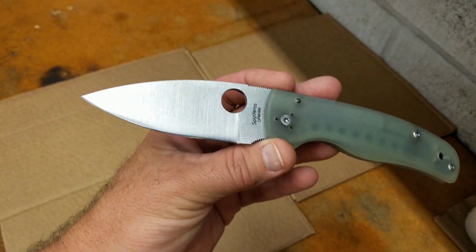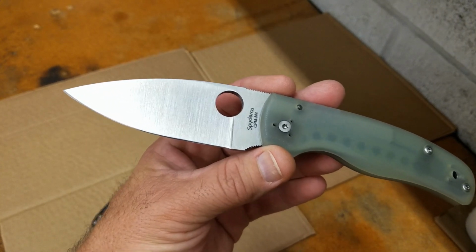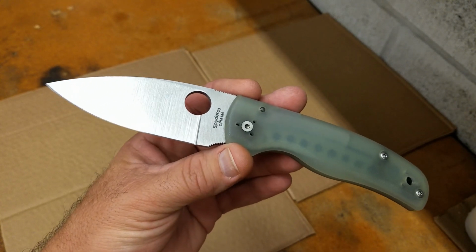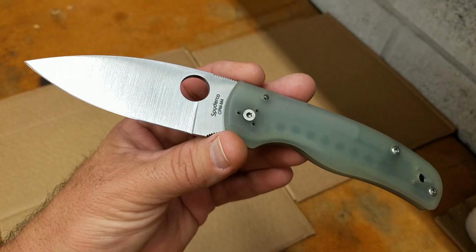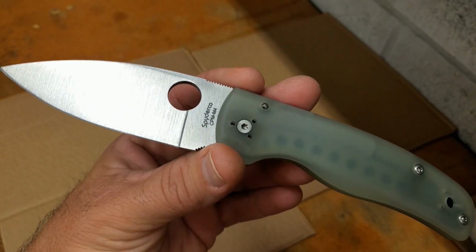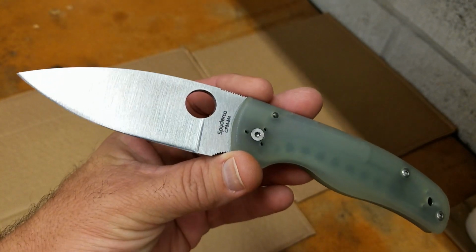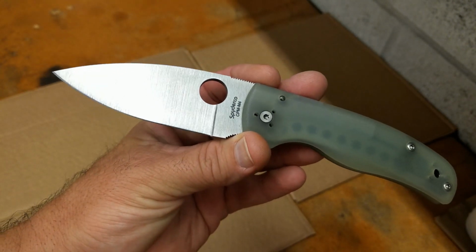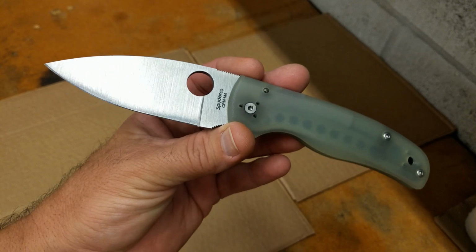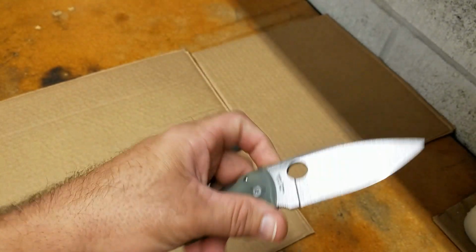And on the first test, this did 209 feet fine edge and 369 feet working edge, which is a great result. The M4 I've tested in the past, some of it I've known to be 63. Some of it I guessed was around 63, maybe 63 and a half. Most of that usually does 180 to 190 feet fine edge and mid 330, you know, maybe 340 feet working edge. So that's a good bump from the extra hardness in this one.